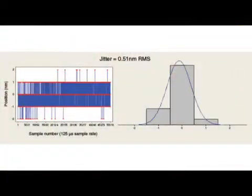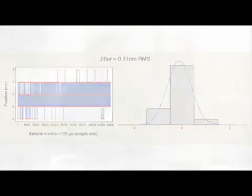Because the encoder is mounted directly onto the axis in question, there is no mechanical hysteresis between the encoder and its mounting surface. The quadrature will reverse down to the electronic noise level of the read head, which could be as low as 0.5 nanometers RMS.